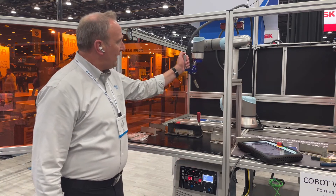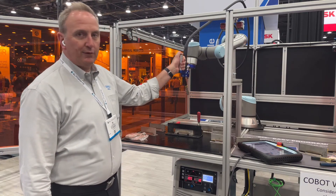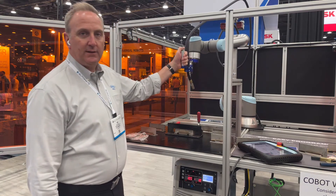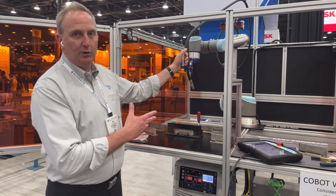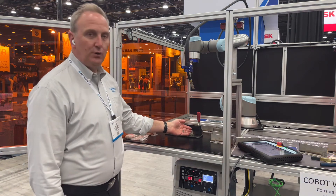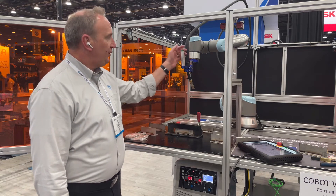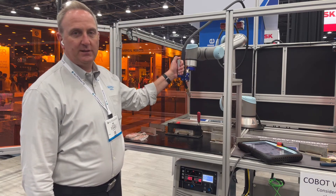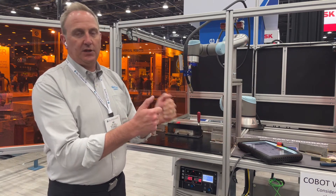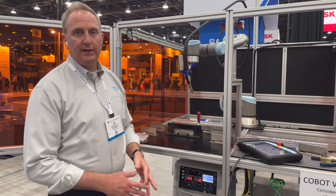We have free drive with this unit, which is the way it's sold. That's certainly great for setting torch angle and also setting your via points. But these Cobots are not repeatable when you're doing lead-through teach. So if you're trying to do a weld and hold your wire in the weld joint, you can't teach those weld points using lead-through teach — you're going to have to pick up the teach pendant and teach it like a conventional robot. It's just not repeatable enough when you're doing lead-through teach.